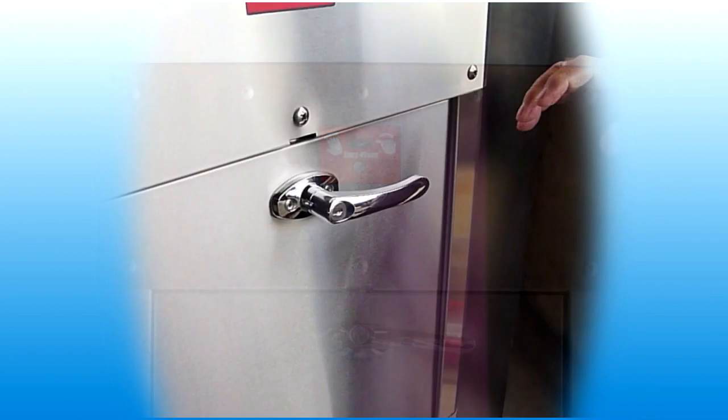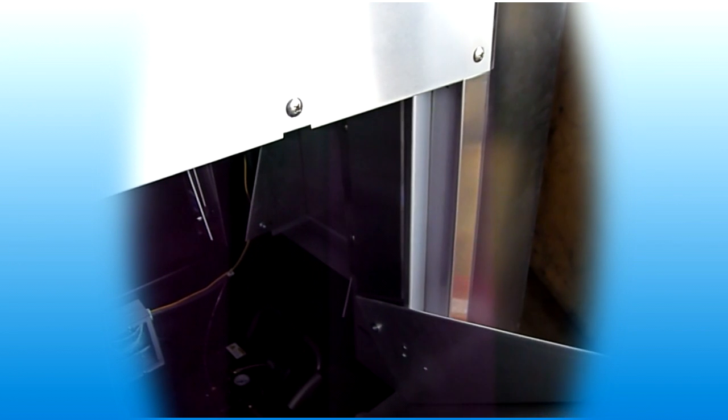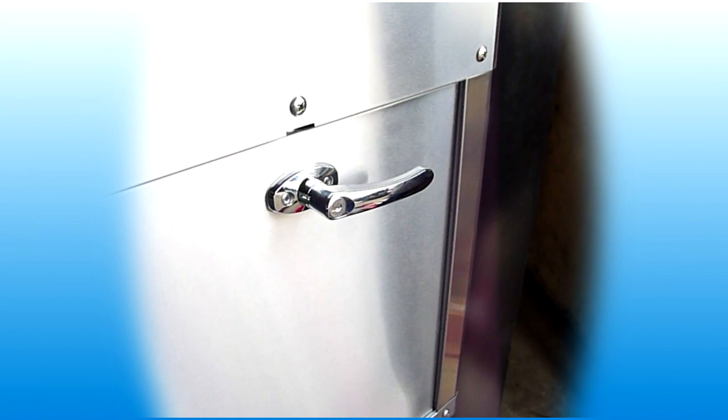As a final part of the chute system setup, all door handles on an electric interlock chute should be unlocked because it's necessary to turn the handle to open the door after the control system releases the locking mechanism.